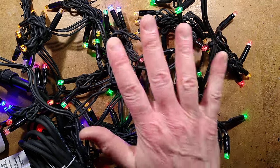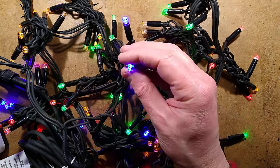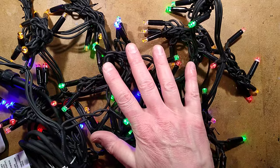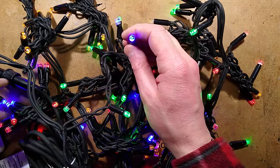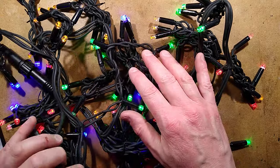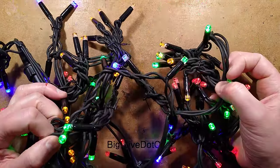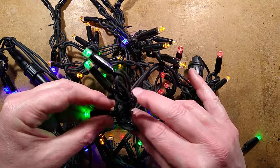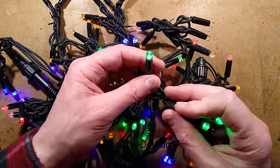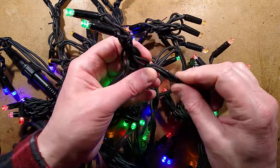It's worth noting again: don't let kids go up to municipal lights and touch them, because installers are often putting mains voltage ones down at ground level. A standard cheap AC circuit breaker will not necessarily protect against DC leakage, because as soon as it goes through a bridge rectifier it becomes DC, which can cause problems with RCDs not tripping properly. You should use at minimum a Type A RCD with something like this.